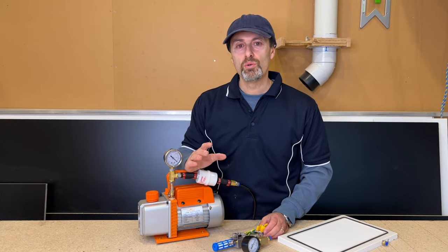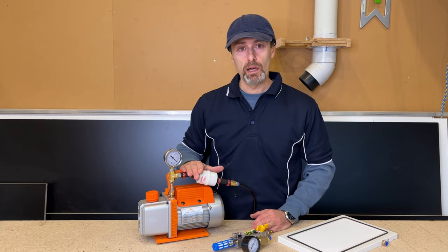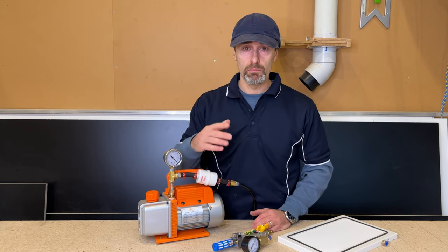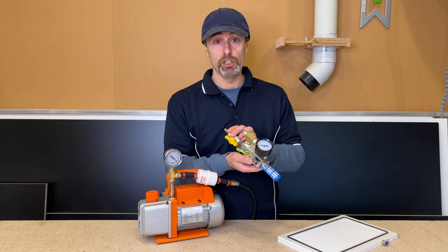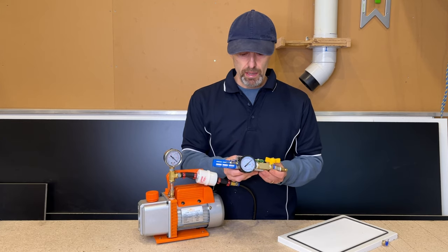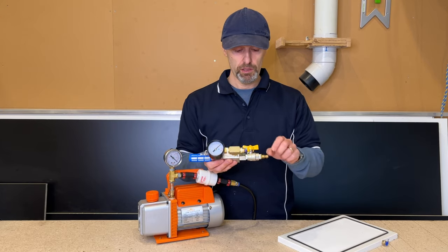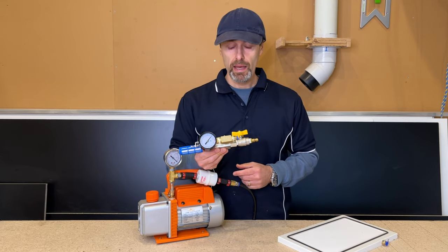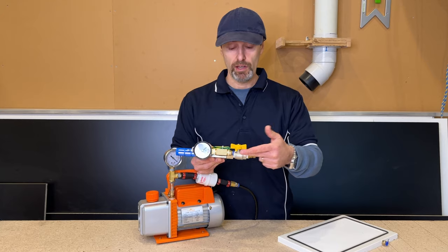Now, in regards to the vacuum setup for this, which is basically going to be doing the job for us, I'm going to be using a little vacuum pump. But there is another option that you can do, and I experimented with this, and that is one of these. It's basically a Venturi vacuum generator, and you can buy these on eBay or Amazon or so on. And these work using your compressor. You just put a fitting on it at the tap. I fitted a gauge on it as well. It's got a little muffler. And this converts your compressed air into vacuum coming out here.